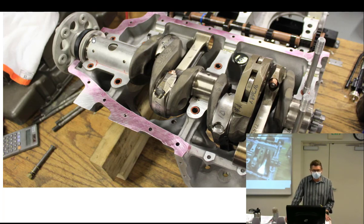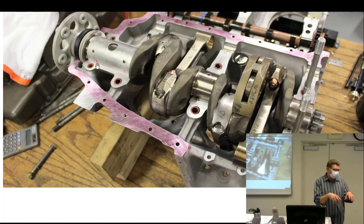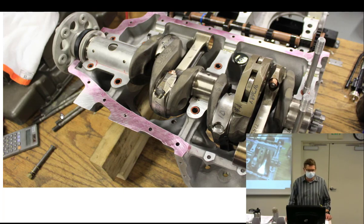And so in order to put that in, you put the bearing on the crankshaft, and then I bring the case up too, and there are dowels that it has to fit in. That's what these marks are representing. You put it together like this, and then mark it, without the crankshaft. Put the bearing in without the crankshaft, then you mark it so you get some reference lines and put it together. I'll try and find something to show you how that works, because it's very important.